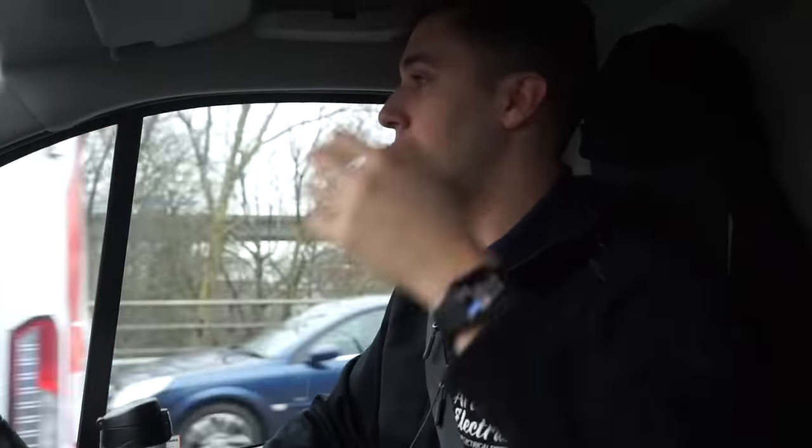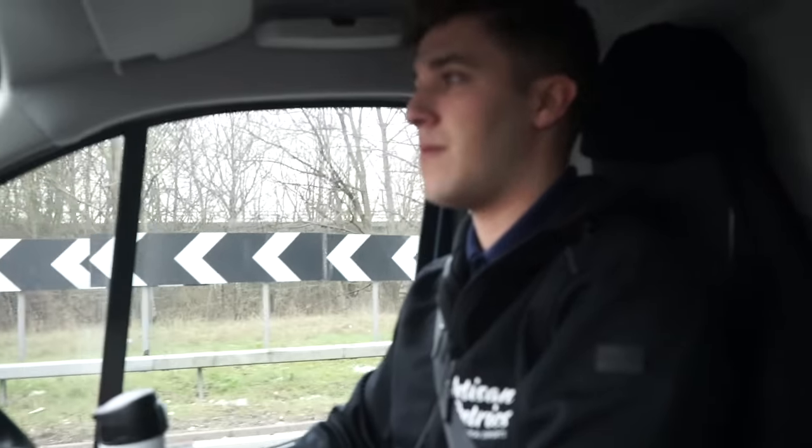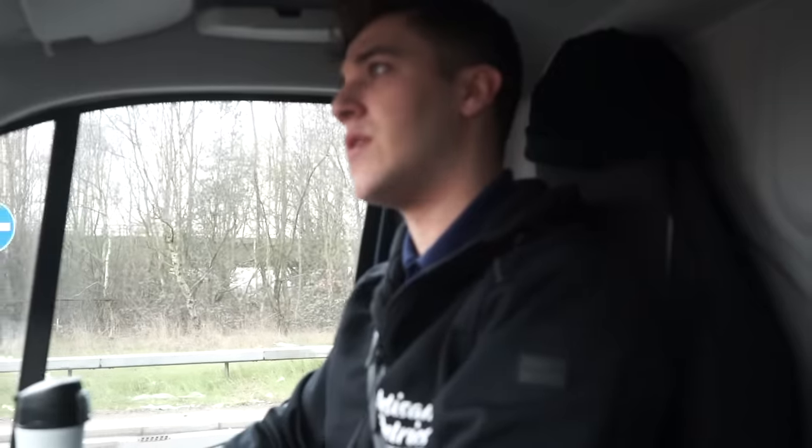Because what we'll usually do is encourage an EICR before a board change. But they kind of want the board changed regardless of any faults that we have to put right. We've allowed some extra time for putting right basic faults that we find. So I'm going to do some insulation resistance and some basic tests. And then I'm going to start changing the board and rectify any faults as we go. So yeah, it should be an interesting one.